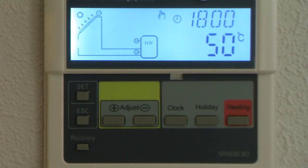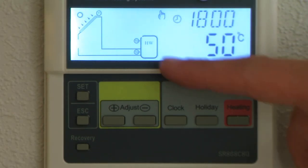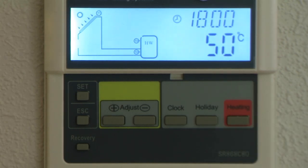This can be overridden by the ripple control or night rater if you've got anything else. This tells you that you've put the heating on manually, and so in about 3 or 4 hours you should have hot water. To turn that off, just simply press the heating button again. You'll hear a little click of a relay coming on and off.